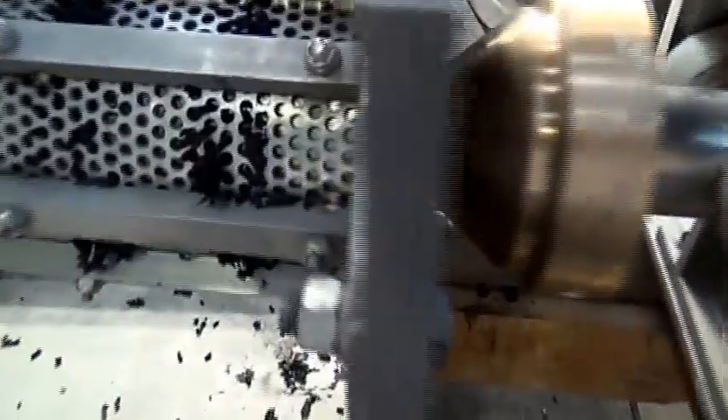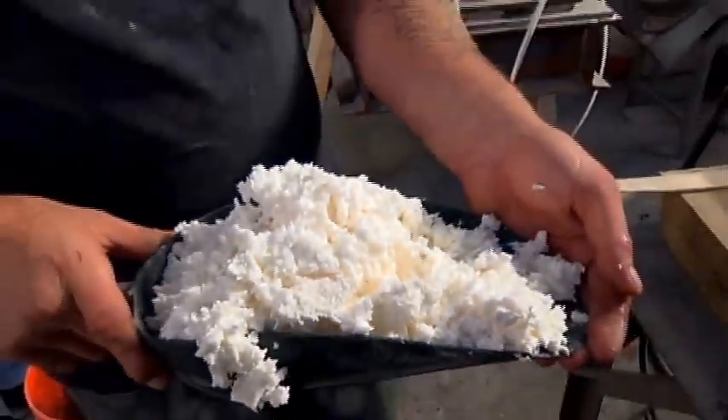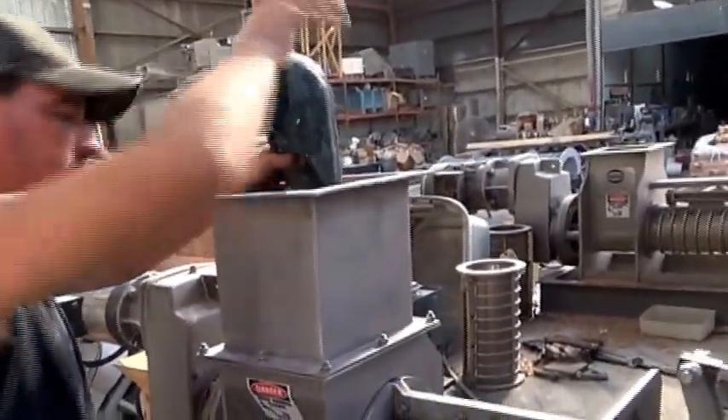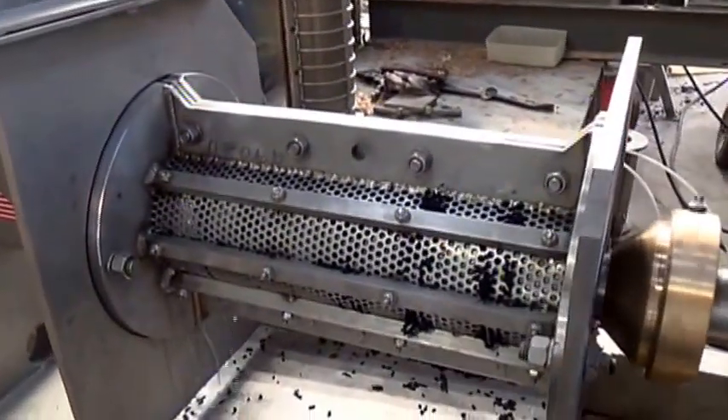We've been cleaning it out. That white stuff you see there is foam — we were running some sort of black stuff. Here's the black stuff. The screen in this press has perforations down inside there that are six thousandths of an inch, 150 microns in diameter. We've poured out the screen down at this end. We're going to run anyway. Here's the material we're going to be running — it's a polymer with water, and we want to find out if it will work in this screen. We think this screen will not blind over.